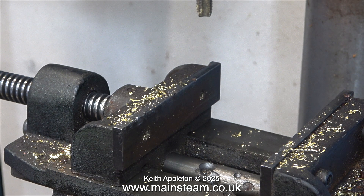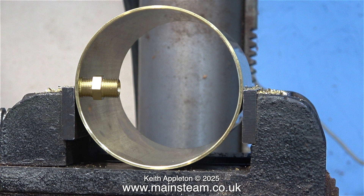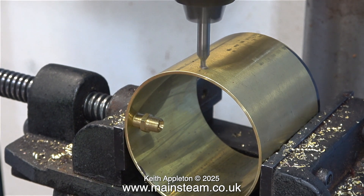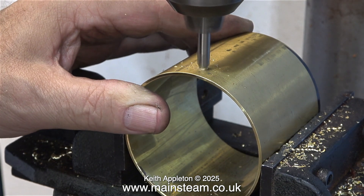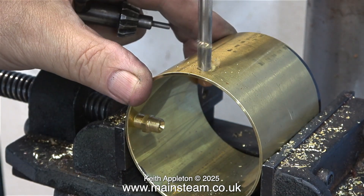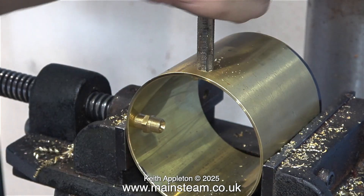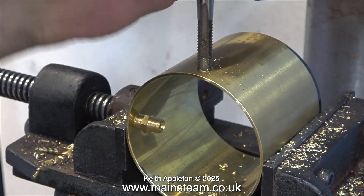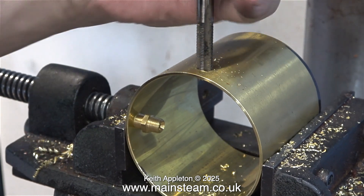On the condenser tanks only, I now need to drill a hole at 90 degrees to the one I've just drilled. The easiest way to do this is to screw a double union fitting into the hole from the inside, but don't screw it in too far — just sufficiently to touch the chuck jaw. That way it makes sure it's square, so when you drill the other hole they will be at 90 degrees to each other. It's a really simple thing to do. I'm sure there's a better way involving either a jig or the rotary table, but by the time I've done all that I can have the parts made.